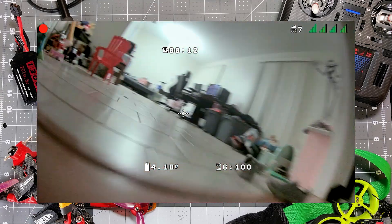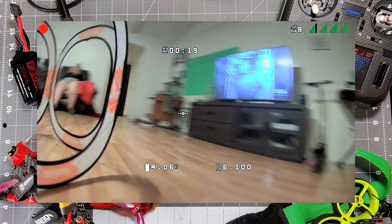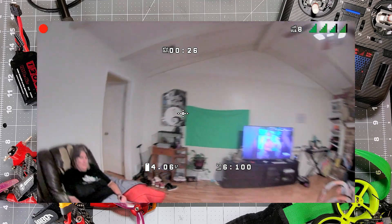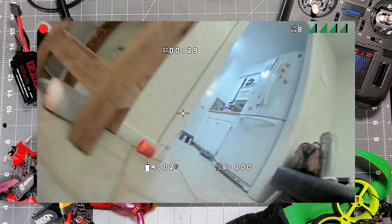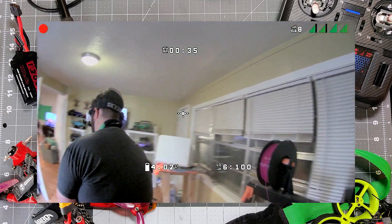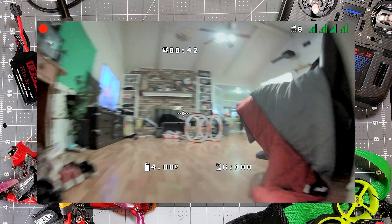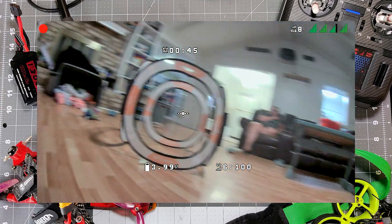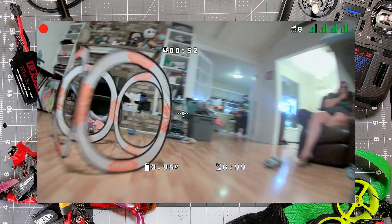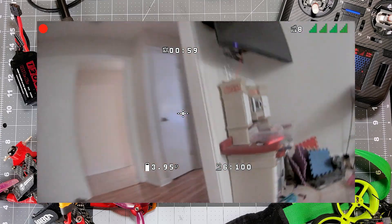My house has a lot of dark-to-light transitions — it's basically one big oval — and you don't see those transitions too drastically with this camera. The little nano camera is doing pretty well. I'm running 200 milliwatts, and for the VRX I'm running the new HD Zero VRX with Lumineer Axie Omni antennas on top and TrueRC Xair patches on the side. I'm not getting any sparkle or breakup, and the control link on ExpressLRS is solid.